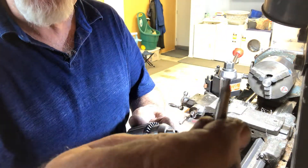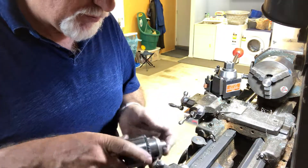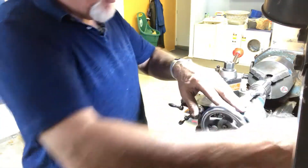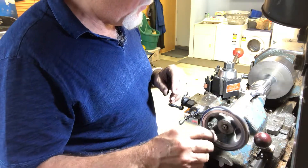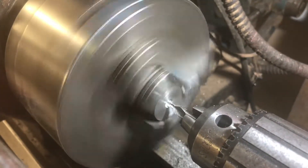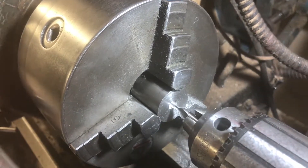Before drilling a hole I'm going to use a centering drill, which is very rigid and doesn't wiggle around like a regular drill does — that's very good for making a pilot hole to start the drill. I'm going to put the taper on the tailstock and tighten that up. Set it at half an inch as a starting point, since if you go forward further than that it pops the Morse taper out. So I'm just going to drill a hole there. You can see here it's a little hole with a countersink taper on it — that makes it easier to get the quarter-inch drill in.